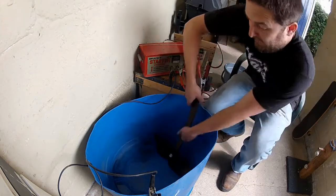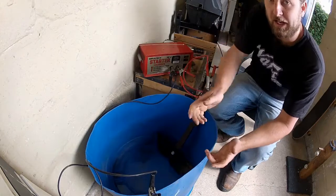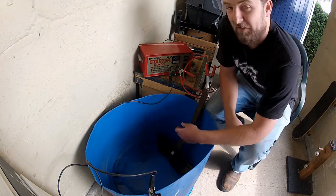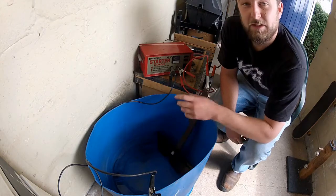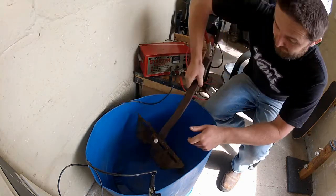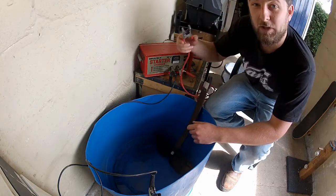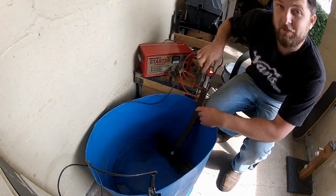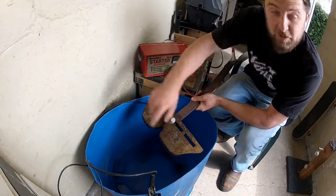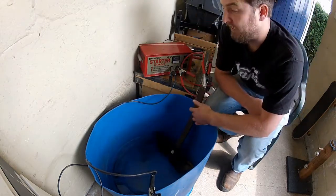The positive side of the battery is connected to my anode. This is my anode — it's steel. You could also use iron for the anode, but in either case, it's very important to know that this is a sacrificial object. In other words, the part of the anode that's submerged is going to get eaten away as part of the chemical reaction that takes place. Hence why I'm using a bunch of farmyard scrap and not my favourite surf tyre levers. It's also important, if you like the condition of your crocodile clip, to get it up and out of the way. In practice, I've found the bigger the surface area of the anode, the better this process works — bear that in mind when choosing something to use for your anode.